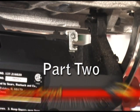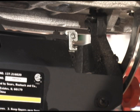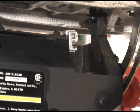We are going to go ahead and put a number five blade in here. I have intentionally picked a fairly small plain end blade to show you one of the difficulties of most entry level saws — that is actually getting the blade chucked up in the lower chuck. I am going to show you the problems with most of these saws and, with practice, how you can get much better at doing it.